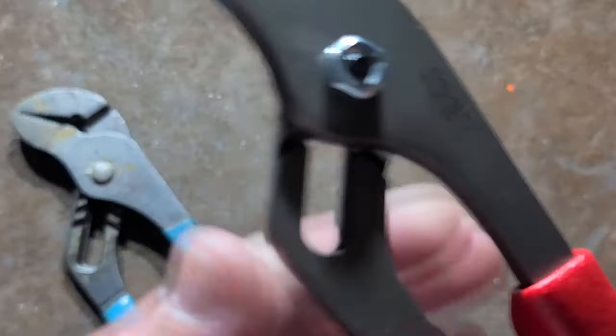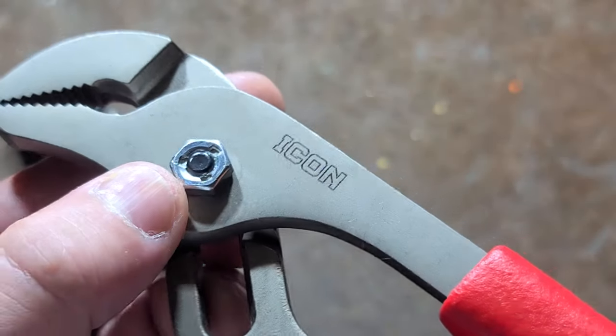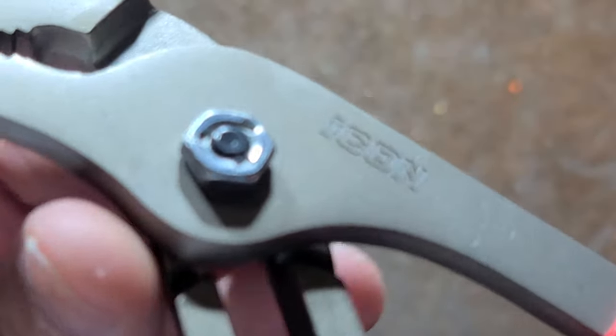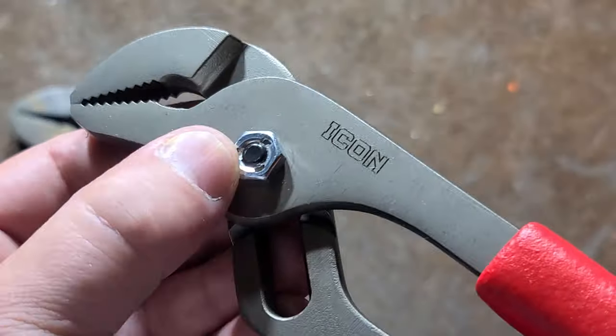But I don't like the way they dealt with the fastener. It is a decently heavy-duty fastener, but they use what is known as a prevailing torque nut — that's kind of like a type of lock nut where they just upset the thread so it really seats tight.